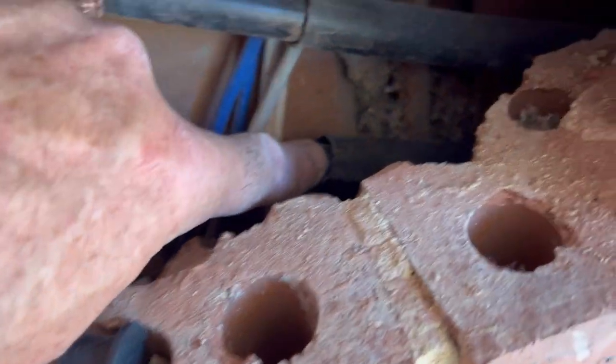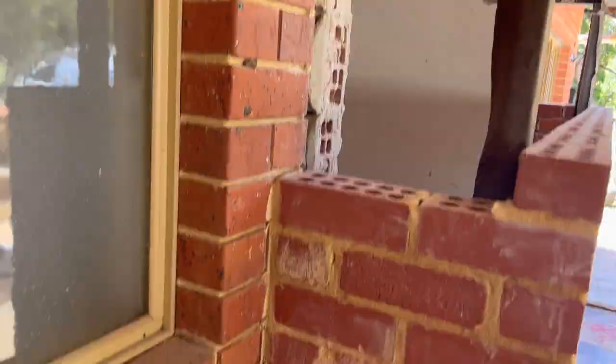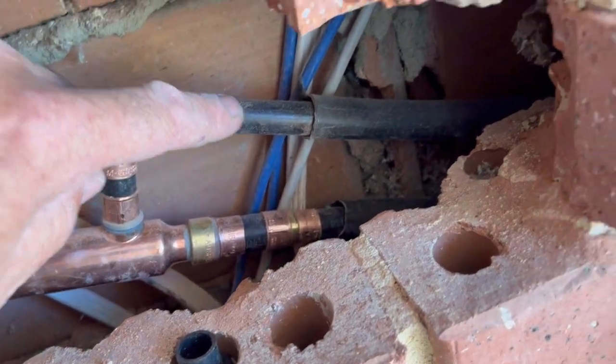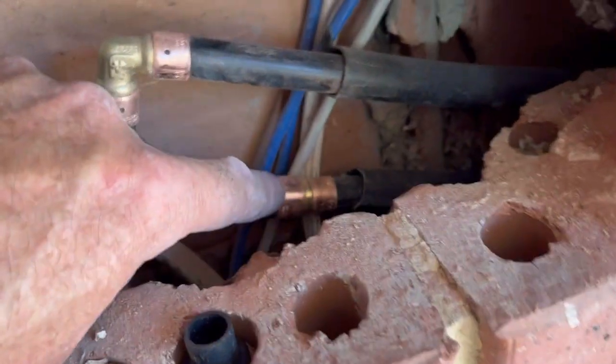This end says 20mm off the end too. I've put a reducer on that and it's a 15mm line that goes off to one mixer, just in the shower on the other side of that wall. The second one goes through the cavity and comes out on the mixer on the other side of the wall — there's a second mixer there.